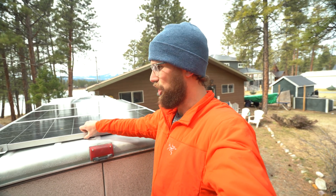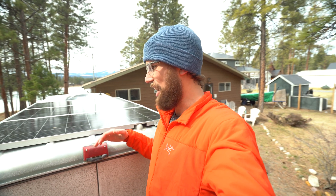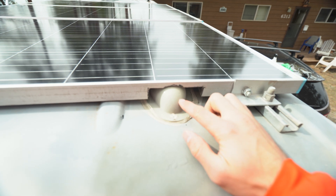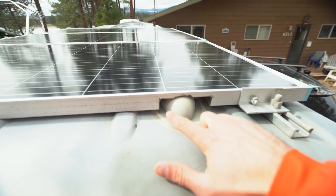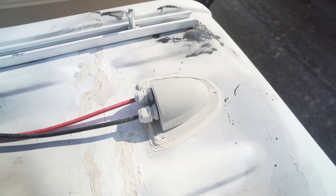Then I picked up some aluminum angle, cut small pieces, and mounted them right to the unistrut using bolts and washers — they're a little bit flexible so I can move them around as needed, and they're not permanently mounted to the van. I also limited the amount of holes I had to drill in the roof to eight, which is nice. If you use the Renogy brackets, you'll be drilling a lot more holes. You can also see right here is the edge of my roof gland, which I'll link in the description — it's around $20–25.